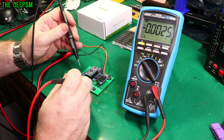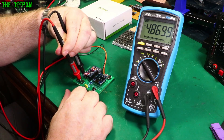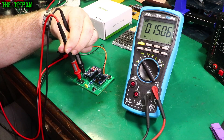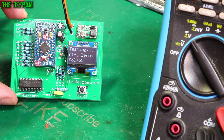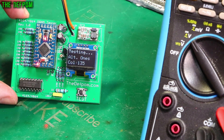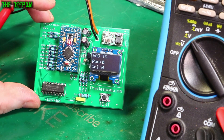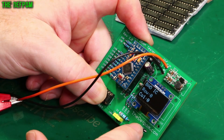Bad IC — could this be a bad connection, or have I got something completely wrong? Let's test some voltages around the place. I'll go from a ground point and then hit the test button — I should be able to measure the voltage coming on. There you go, voltage does turn on to the chip. Got a bit further this time, so probably it's just about the connection. I don't even want to solder an IC socket in for this thing. I've tilted the chip over slightly so it's pressing a bit harder and it looks like it's working now — it'll just stop as soon as it finds a fault. Looking promising.